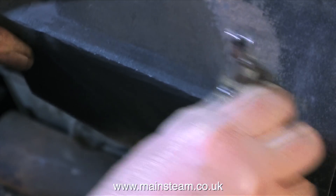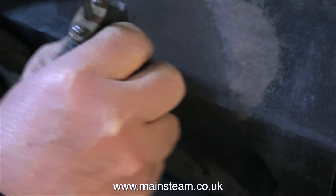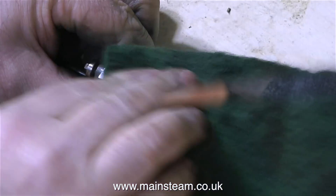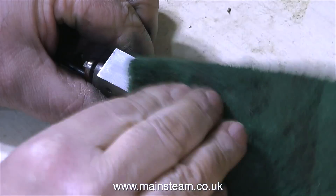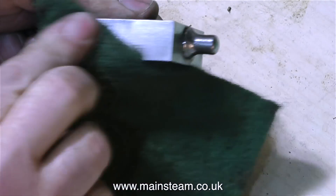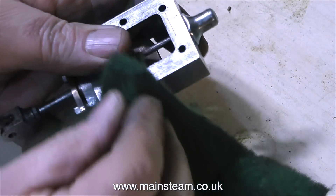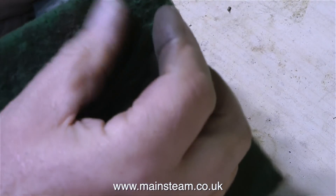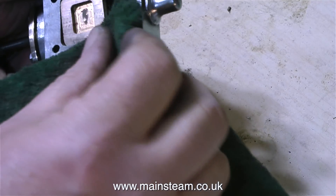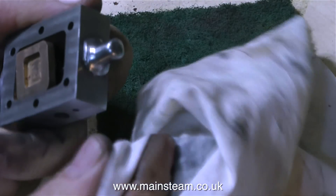I really don't want to round off any corners of the steam chest, so I'm being very gentle. Throughout this operation I've been using oil on the emery paper. Eventually, after considerably more time than shown on the video, I'm using scotch-brite to finish off the component - I don't want it highly polished so it's not going on the polishing spindle. Using exactly the same process I cleaned up the cylinder cover and the steam chest cover. All the parts look a good bit better now. That's it for now - thanks for watching and I hope you found it useful.